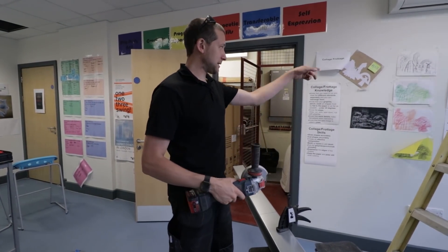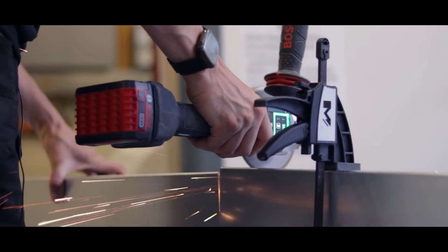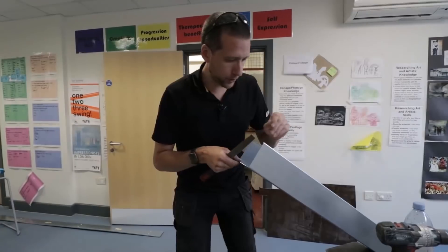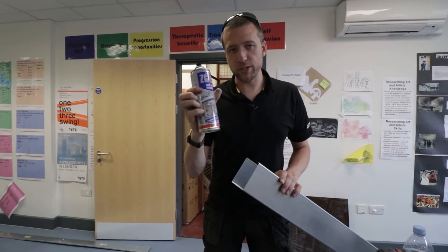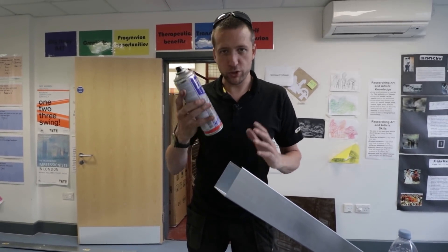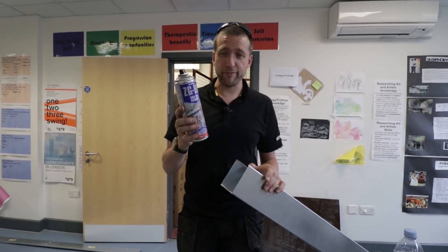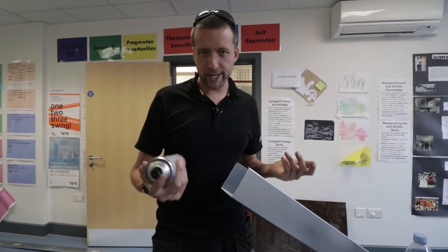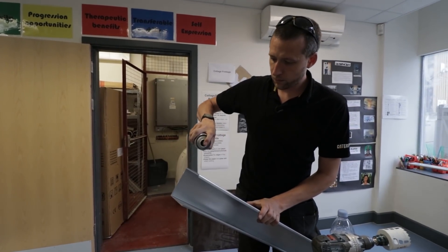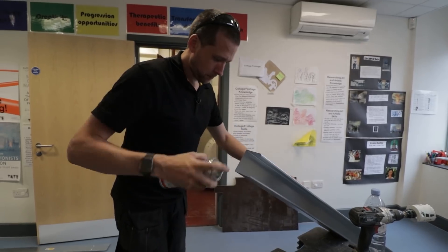Let me cut this — I've actually measured it already. When you've finished your cut, put a bit of cold gal spray on it. I use ZG90, but most wholesalers have this and you can just pick it up off the shelf. It's quite a premium one, but if you're in a pinch — Screwfix, Toolstation, all the usual wholesalers. Most cold gal sprays you can buy for about a fiver a can, so they're not expensive. It is good once you've finished your cuts, especially if it's outside. Just give it a little spray.